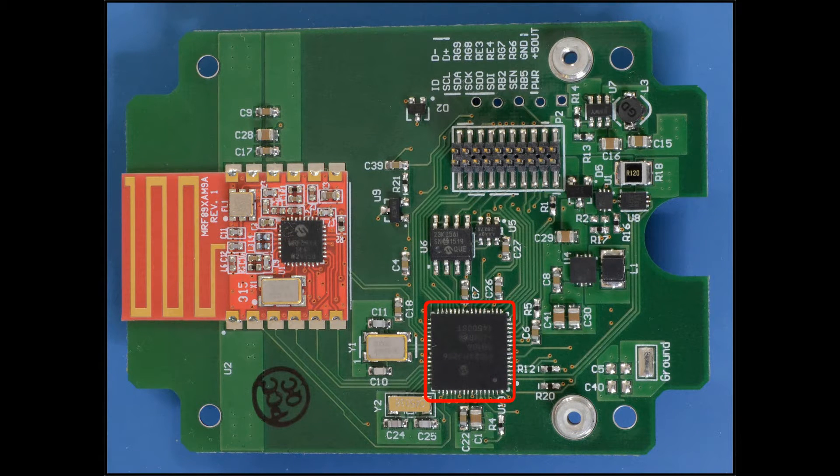The project uses a low power 16-bit microprocessor from Microchip. The PIC24 GB106 part is a good choice because of its low power operation and has USB on-the-go. If encryption is required, the part is footprint compatible with the GB406, which offers a hardware encryption engine.